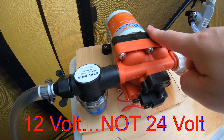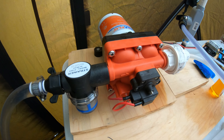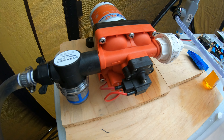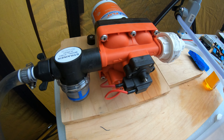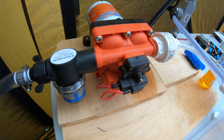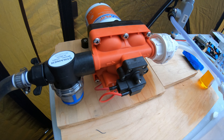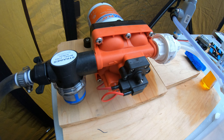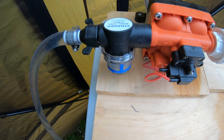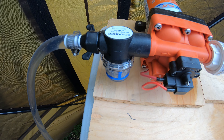This is a 24-volt pump from Seaflow — I'll put a link down in the description for it. Fantastic pump, it works extremely well for this application. It's meant for an RV or a boat or something like this, so for a very simple plumbing system like this it's way overkill, but it gives us tons of pressure — much more pressure than we have at home. So it makes it a joy to spray the dishes. The water comes in, there's a little strainer here — I just keep it there so the pump has full protection, but I make sure I get good clean water to send through it.